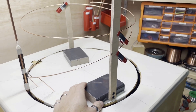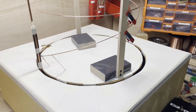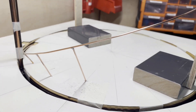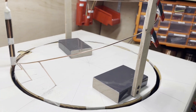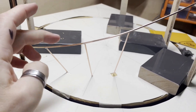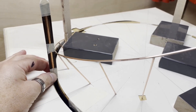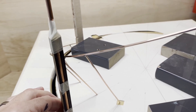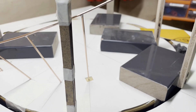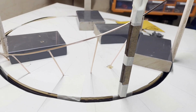I've made these kind of temporary wooden supports that can move about and allow me to put the copper up on there. I'm just kind of working my way around — I've done the first three, and I think I'll do another one here, and then maybe I'll think about doing the outside track. So that's 5 solder joints and 5 supports done. You can see as I move this round, the gap between the rail and the upright stays in line, and everything's in line with my radial pencil lines that I did earlier. So everything is coming out from the centre.